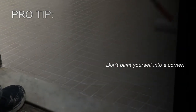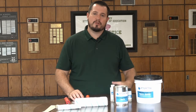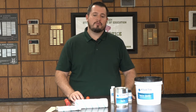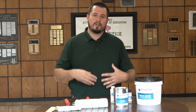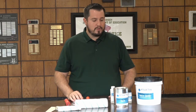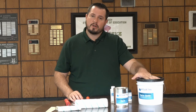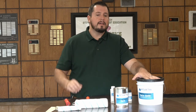Okay, so now you've seen the process from start to finish. You saw the first step, which we used our Eco Degreaser to clean and get all that dirt that's been built up for years out. You saw us use our moisture blocker to prevent any moisture from coming up from the ground to come through this new sealer that we're going to put down. You then obviously saw our grout sealer to get that color back to that original luster that it once had when the bathroom was brand new. And then our fourth and last step, which was obviously mixing our product and applying our top coat, which is going to give it that nice, beautiful shine.